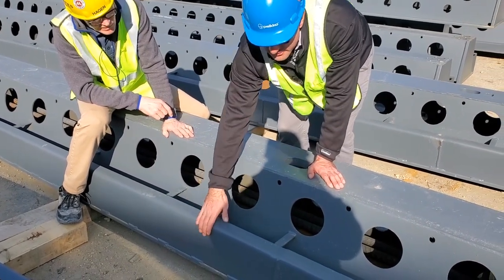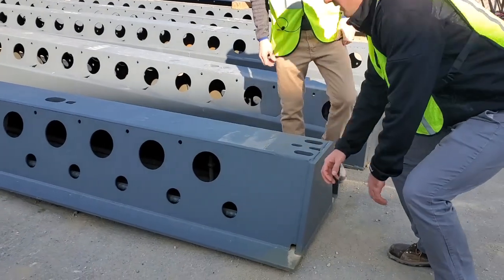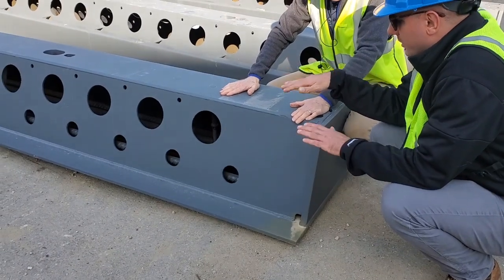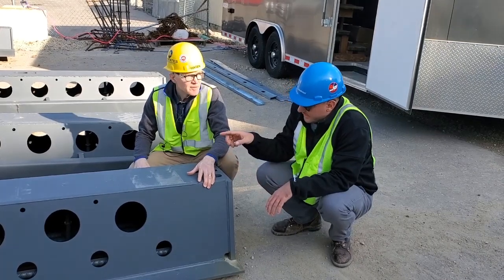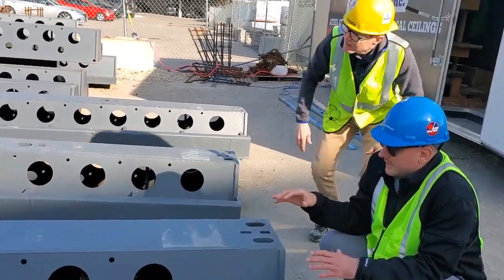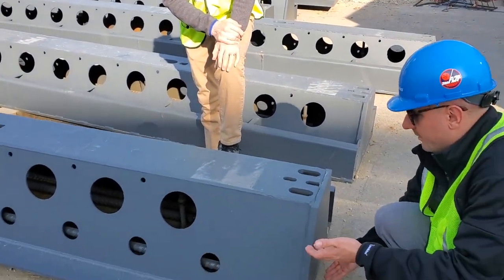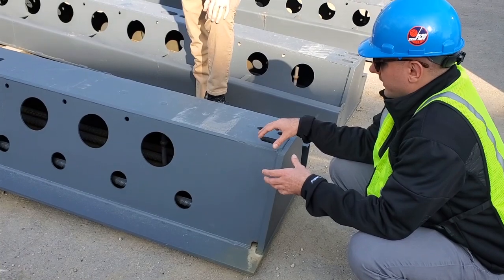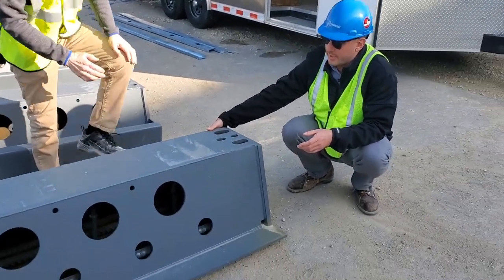This will still be exposed. And if you look at that first beam up ahead, on this particular side, this will actually accommodate a difference in elevation — so on one side the hollow core will be higher up, but we're accommodating that change of elevation. In terms of the overall design and how it's manufactured, you can see there is some pre-camber on the beams. Yeah, I didn't notice that before. That is designed in. It's several steel plates — the bottom plate will be pre-cambered — and everything's cut on a big plasma table. So in terms of changes of geometry and customization, really the possibilities are endless. The top plate, the bottom plate, and the webs will all be cut on that plasma table.